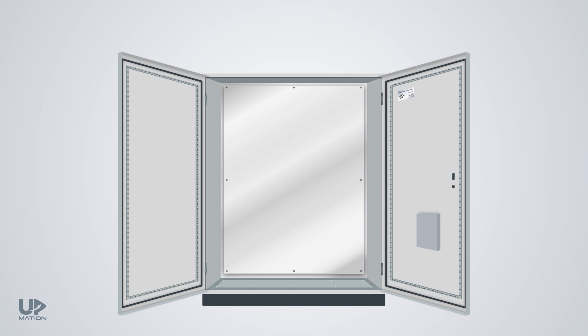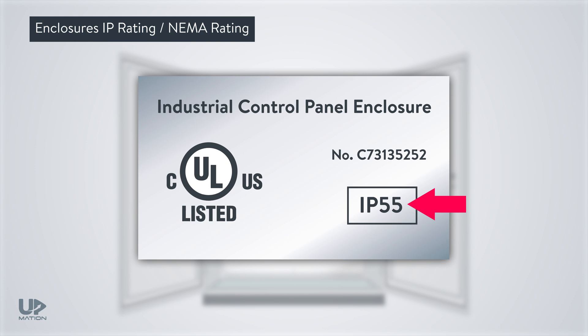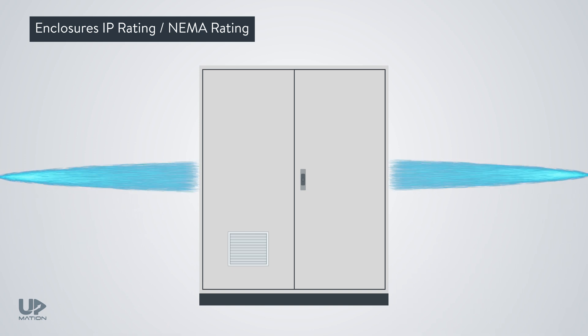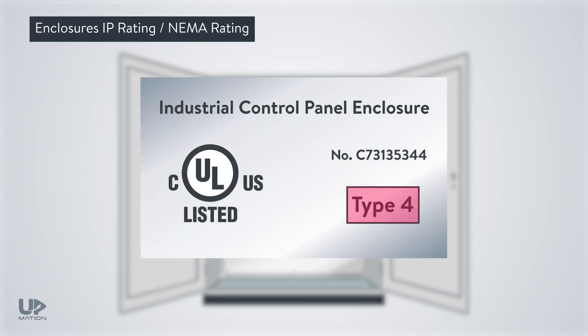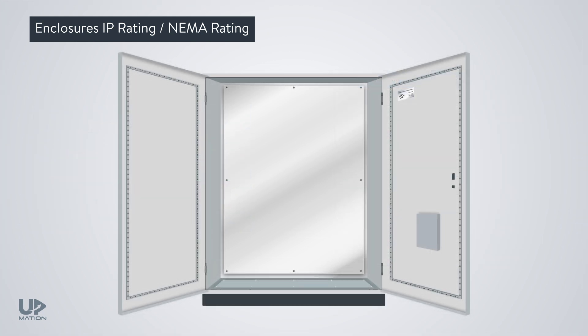An important point about electrical panel enclosures is their ingress protection rating — IP rating — and their NEMA rating. The IP rating, usually found on a label within the enclosure, is a two-figure code showing the level of resistance against dust and liquids. For example, a device with an IP55 rating has limited ingress protection against dust and low-pressure jets of water from all directions. NEMA ratings carry the same meaning as IP ratings but use a different style, and most of the time a specific IP rating can be matched to a NEMA rating. If our electrical panel has an IP55 rating, after cables have been entered, the glands help us maintain that degree of protection.